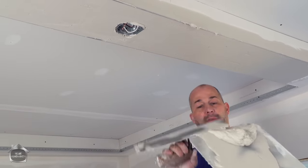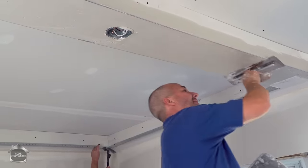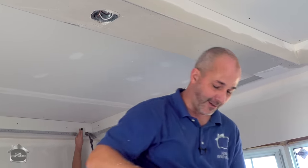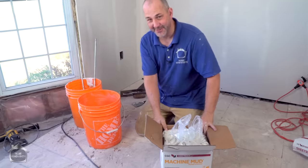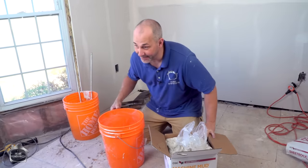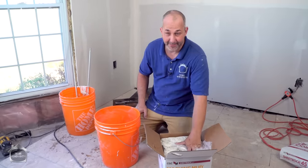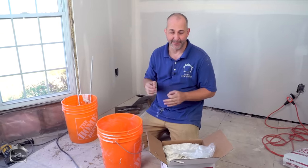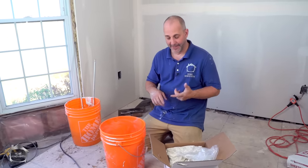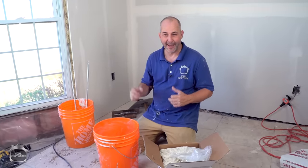Like I said, don't worry about the look of this. It's the function that's important. The fact that that is filled up, that's all that matters. So just to recap, because I know when we do these types of videos, people get a little confused. We're using our all-purpose mud for everything, and we use the 45-minute mud as a supplement to help speed our process up. So you can fill all your gaps and cracks. You can use it as the first coat on the corner beads just to fill the gap.